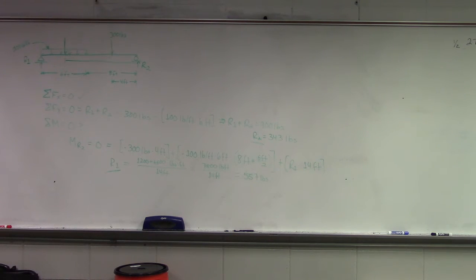Is this greater than 1/3? The ratio. It's only 1 or 2. You know, it's greater than 1/3. 1/2 is bigger than 1/3. So you need the shear walls, so you have 2x6s, exterior shear walls. 2x6s.